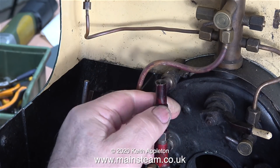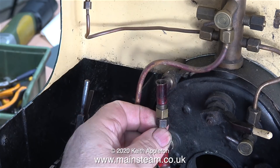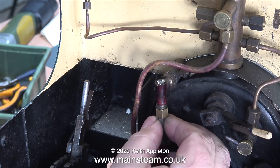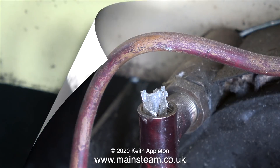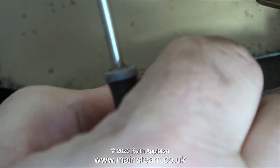The first thing to do is to unscrew the gland nuts that hold the piece of glass in place, after removing the incorrectly threaded top cap. In this part of the clip I'm rotating the glass and pushing it out of the top — and oh look at this. The top of the gauge glass is quite badly broken, so I remove the broken bit and now this is what's left: a piece of glass tube.